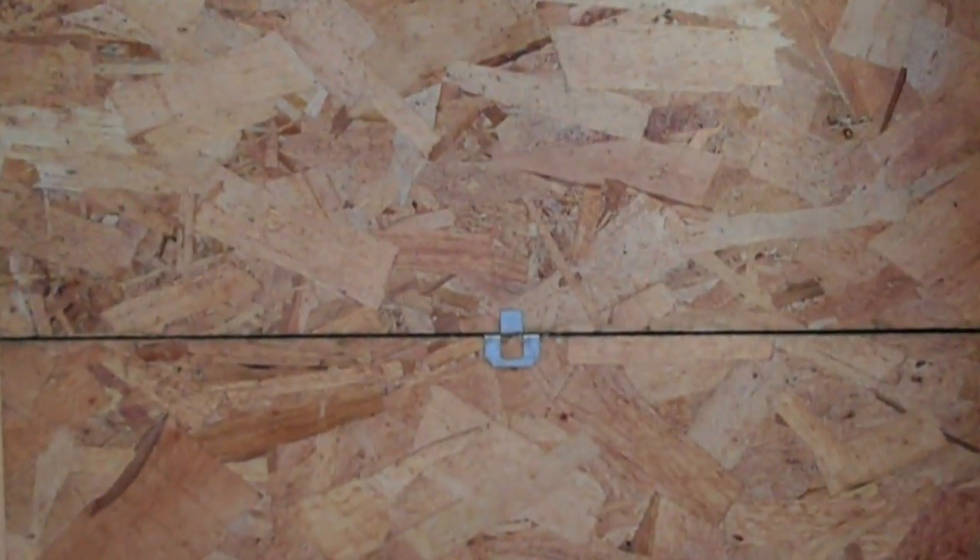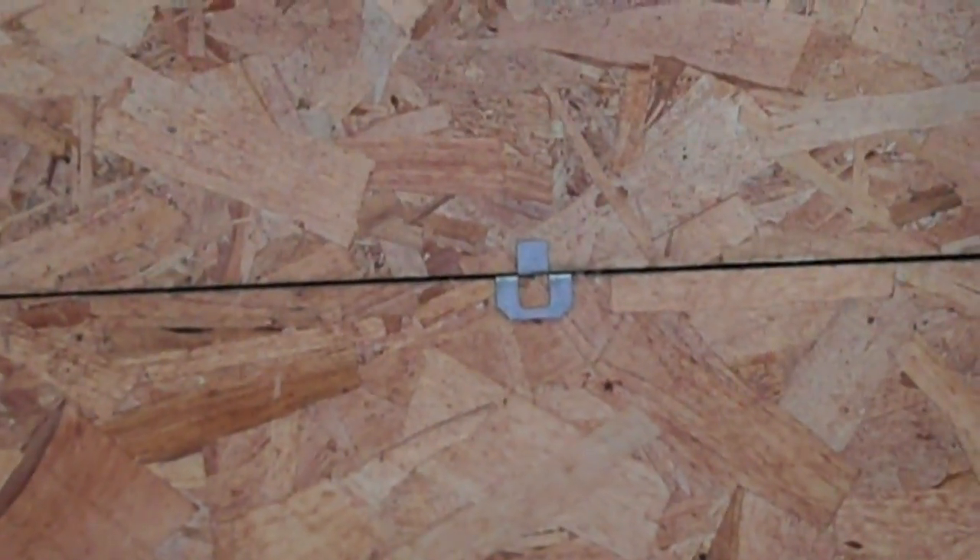The roof construction I wanted to point out — if you notice right up here, there's a metal clip. We call those H-clips. Plywood fits into that H-clip, and any time you put metal together with wood it makes for a much, much stronger roof. Some older houses you'll see the roof wave from the outside — that's because it's giving up in the seams. With that H-clip up there, that doesn't happen.